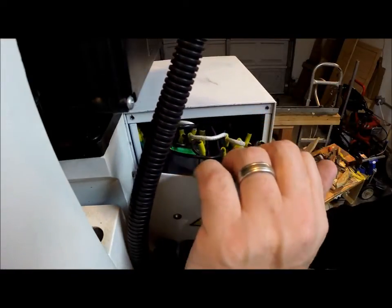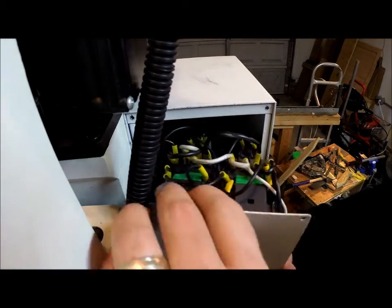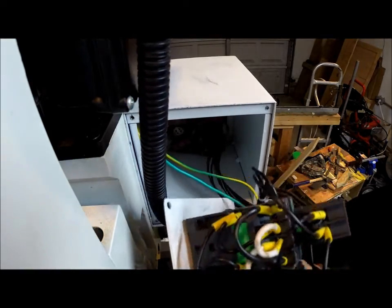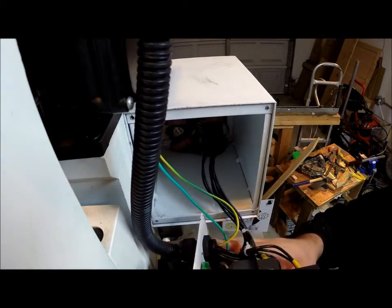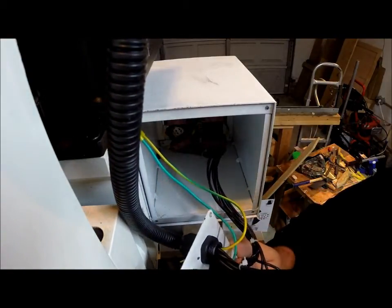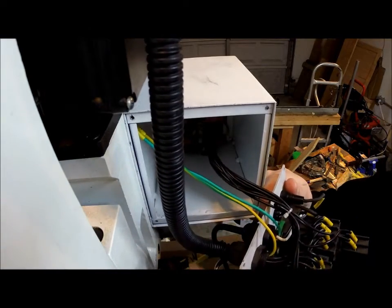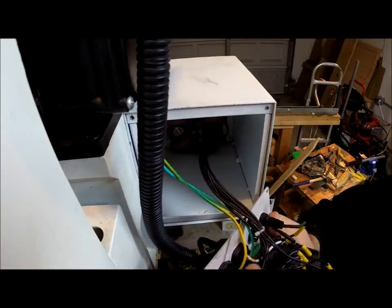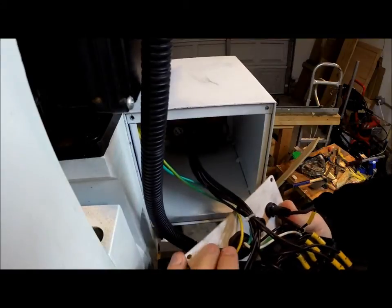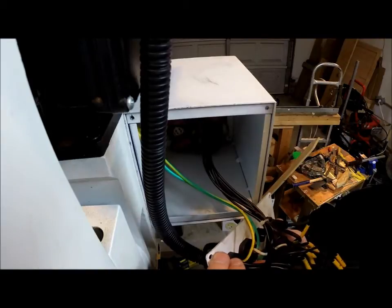If we can slide it off. We've got a lot of stuff wedged into a very small area here. Wow. That is a lot of wires. So you guys can see that. Just coming out from the motor, I've got 4 wires. So I'll have to disconnect each of those from the terminals, which appear to be all jumped.